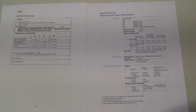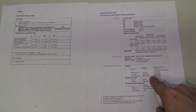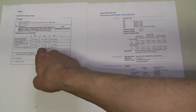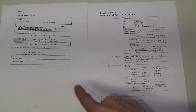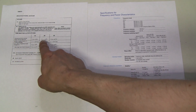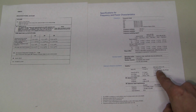Let's have a look at the specs. These are the specs for the counter and these are for the Agilent signal generator. Here we have Option 4 time base, and here we should look at the column for Option 1E5. The first number to compare is the aging rate: 24 hours, 1 part per billion. The corresponding number here is 0.5 parts per billion, so it is 2 times better there.